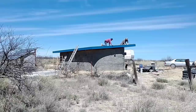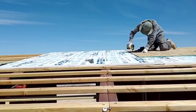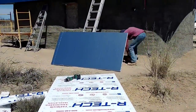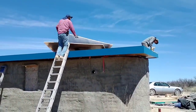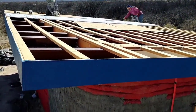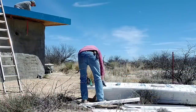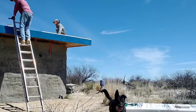With the eaves done and painted, we are finally ready to move on to the deck. We are starting out with just the purlins attached to the metal beams, and the first layer we are adding is a one inch thick foam board. We want the seams of this foam board to be staggered with the seams of the next layer, which will be the wafer board — the actual deck. We are cutting down the first pieces of foam board. To keep costs low we are just using one one-inch thick piece of foam board here; you could go a lot thicker.